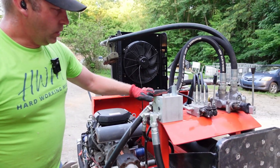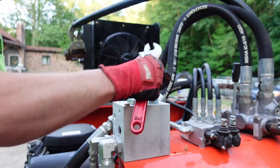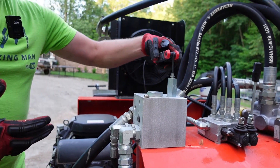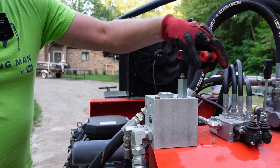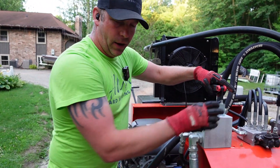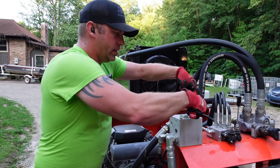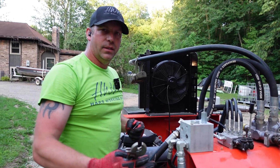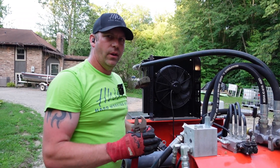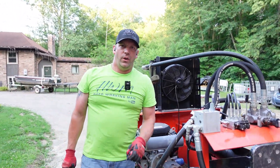On the Allwood Musclewood, there's this block up here. To adjust it, you just loosen this set screw and then you have an Allen key. I already know where the setting was, so I went two turns back and now I'm back to where I know the setting is right. I'll re-tighten the set screw. What that's going to do is require more pressure to kick it into stage two. You'll hear the motor will probably just start to bog before it slows down, but it's not going to slow down near as much with this beech.